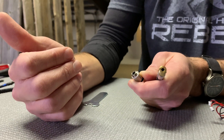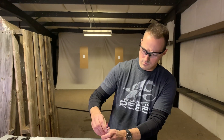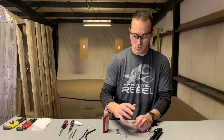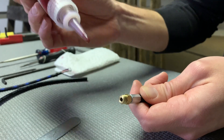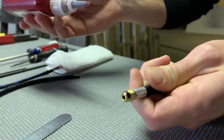So we generally recommend using a liquid thread sealant — we recommend Loctite 545. We use that to assemble all of our air systems, so we know it works very well. First, if it has black Teflon tape on it, take that off and make sure the threads are clean. Use rubbing alcohol to make sure any oil or grease is off the threads so it's going to adhere correctly. You don't want to get the thread sealant over the end of the fitting — stay on the threads itself. You only need a drop or so.